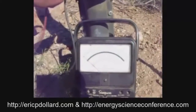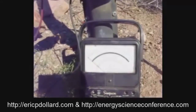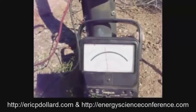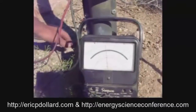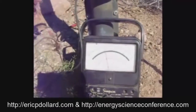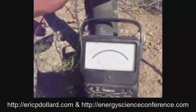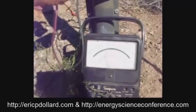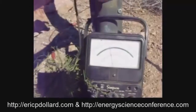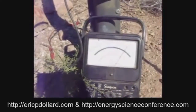They're much closer to polarity. This spot has got the highest potential difference. That's the resistance of that ground rod down on the wash against the station ground. And that's the one down by the wash against this ground, which is closer. The station ground is more solid. The station ground rod is pretty well connected because we're close to it.